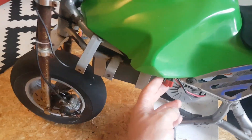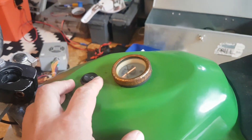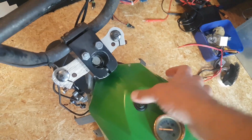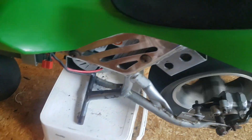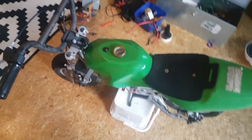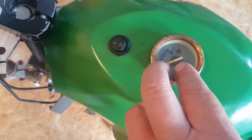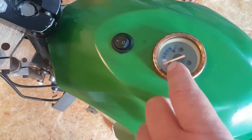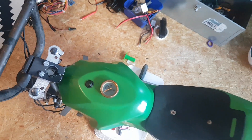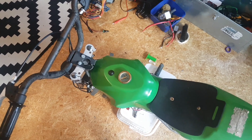Reinstalled it. So now we've got the charge port here so we can charge, and then we've got power off and on — it's off, nothing. Sweet! So that's a couple of fixes there. What I'm probably going to do is measure the actual voltage of the batteries, then make a voltage divider across the outside of this — change 36 to 24 — so it hopefully gives some gauge of where the batteries are at.